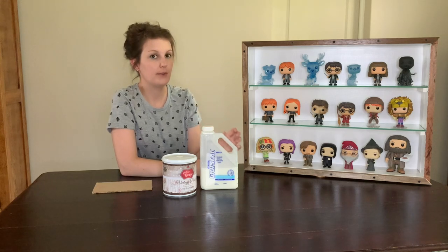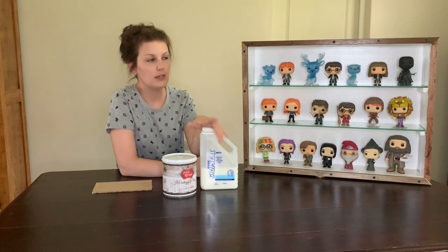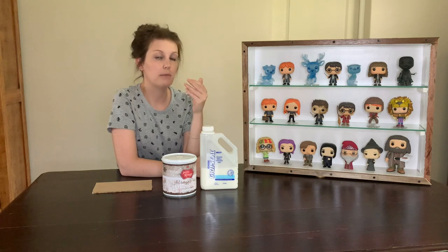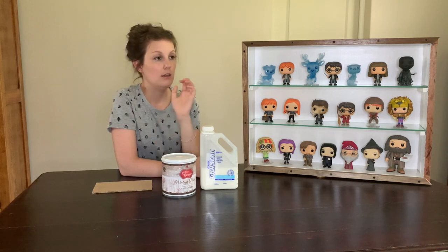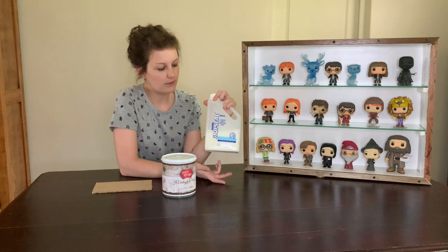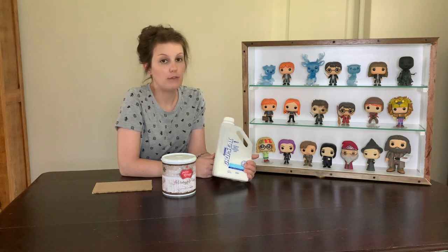This is a very dark wood, so the outside will stay that nice natural wood color, and the inside is white. But with dark wood — especially treated wood — the natural oils inside will come through any white or pastel color you paint over it, and it comes through as a horrible yellow. You can paint 100 layers of white and it's not going to go away. So I always seal the inside and outside first with varnish. I use a grip seal clear varnish from Builders Warehouse — it's water-based and quite expensive, about 240 rand, but you get very far with it.